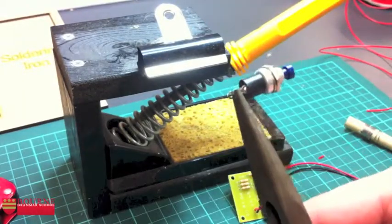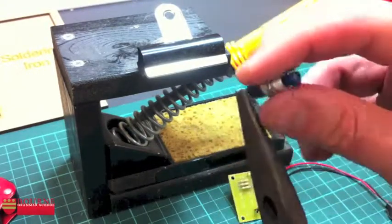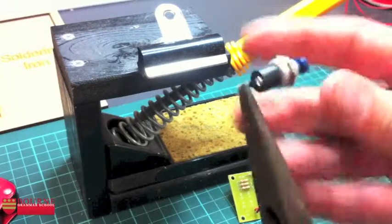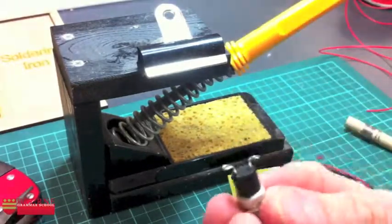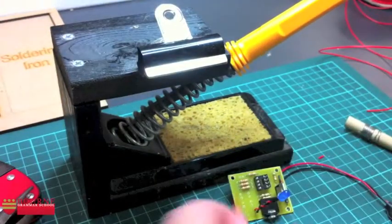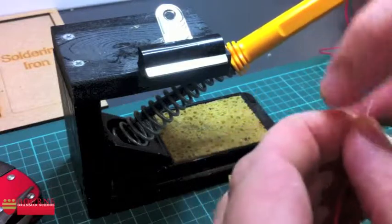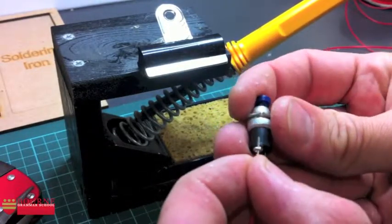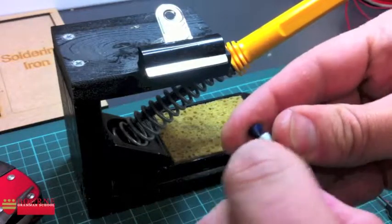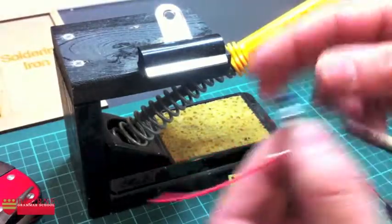So I'm gripping it like that, and then gently, with one finger, bend it out 90 degrees, get hold of the other lug, one finger, bend it out 90 degrees, so it looks a bit more like that. And you can then push your wire through there, through the little hole, and just bend it back on itself, and that will sit there really nice and well behaved for you and make it easier to work.